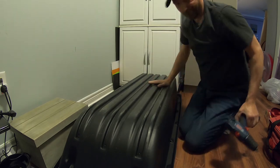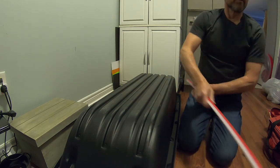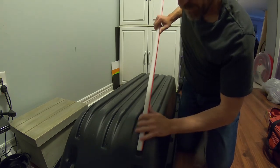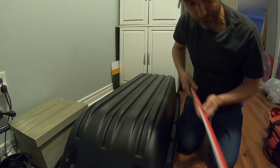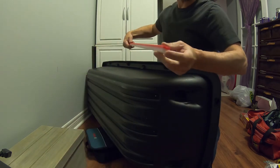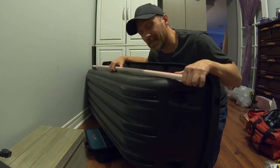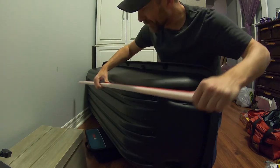We've got 18 holes drilled. Now it's time to fasten one end to the sled. What they want you to do is use that pre-drilled hole — marked in at half inch — flip this over and put a screw in so you can bend it around. I'm going to start by installing the first runner. At my drill point I've already started a screw in the back side here. It's probably best to have two people doing this job, but I'm going to give it a go because I'm stubborn that way.